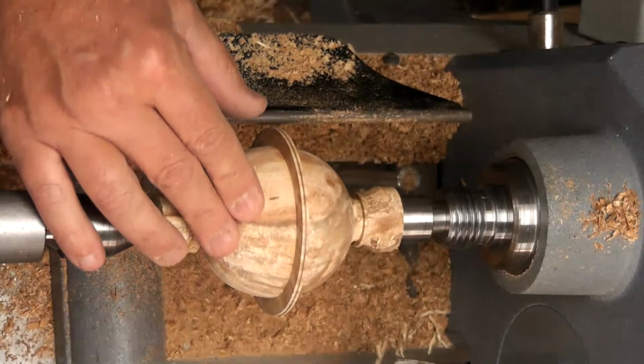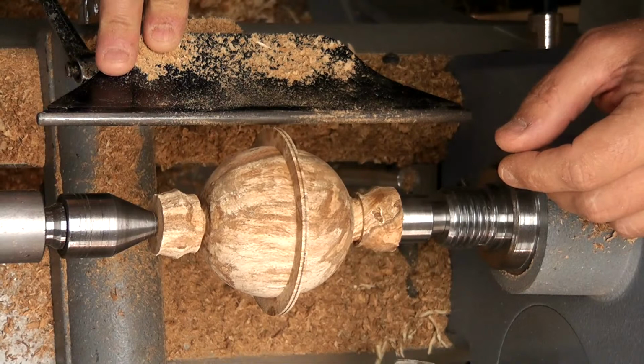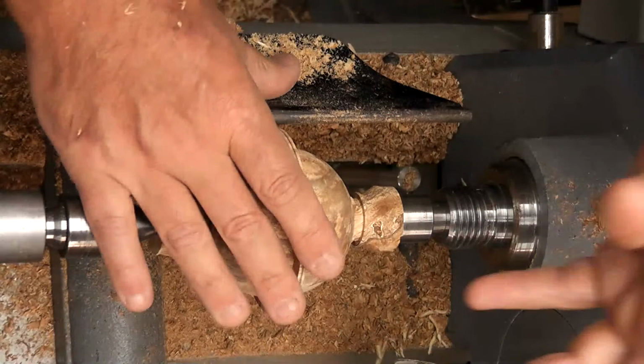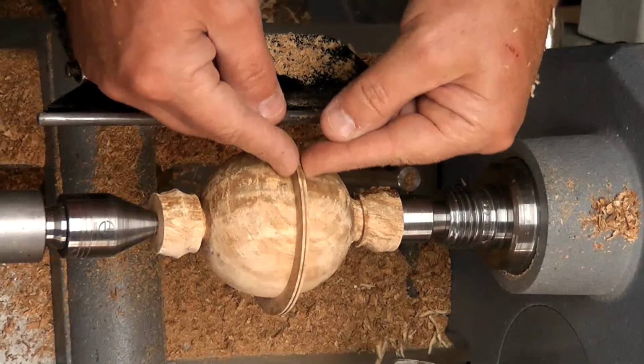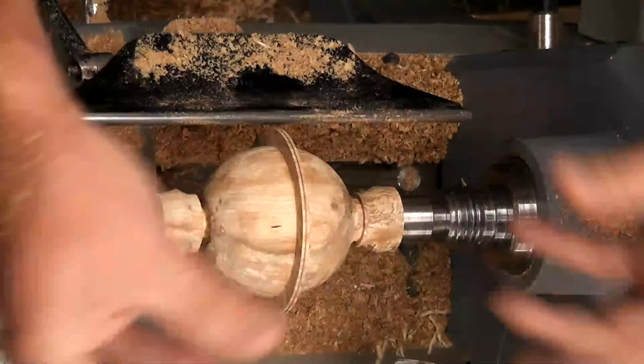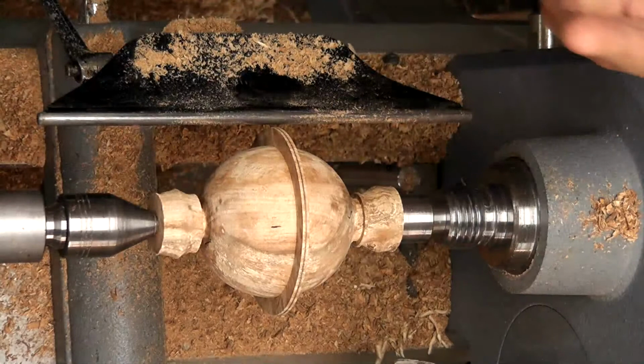So a question for Maria. She says she finds the use of a semicircle template very useful. Would you recommend something like that? So yeah, absolutely. If I'm making bowls for patio skittles, for skittle alleys, that sort of stuff, I'll always go with a template. This one's a bit difficult purely because of this satin ring here. But also if I'm doing a bowl, we would flip this 90 degrees. So we're turning around in two dimensions sort of thing. So there, flip it over onto its side with cup centers, and that will take out and create that perfect sphere.